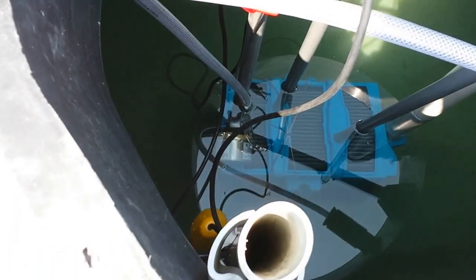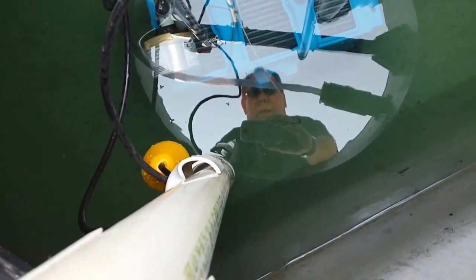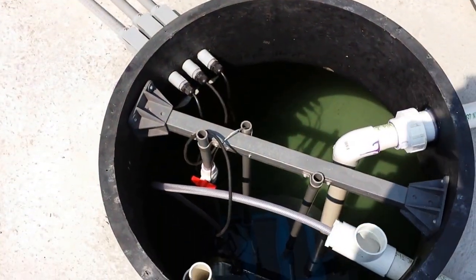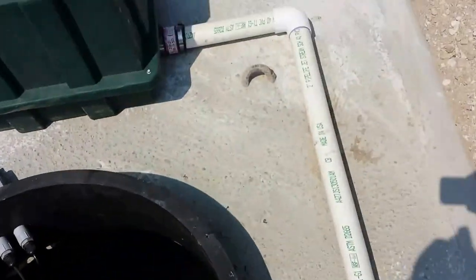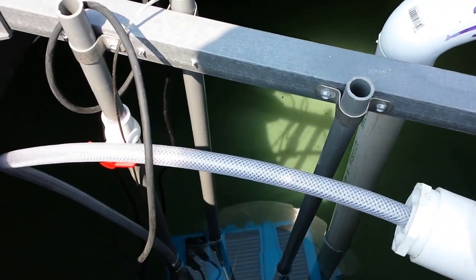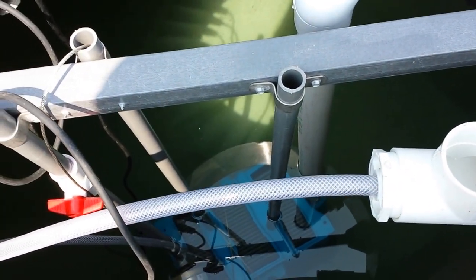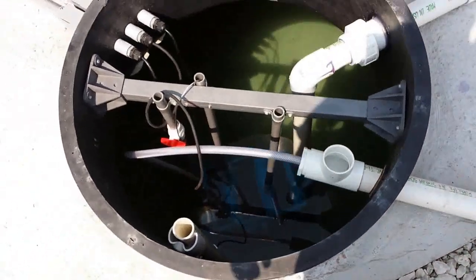Also, at the bottom, there's a cord grip. The float tree is also in this, and you can see this is in short or long-term rest right now. We did seed this with activated sludge, although it looks pretty clear — it's been seeded already. The disposal area — you'll notice the pipe coming up from the BioBarrier comes up in a straight line, and it allows air that would be trapped in the BioBarrier to escape by gravity; otherwise the pump can airlock.